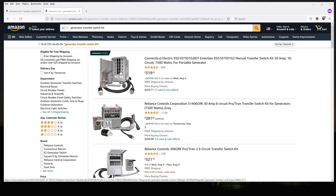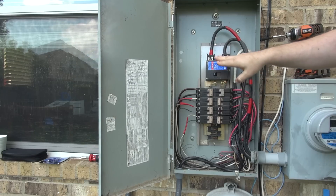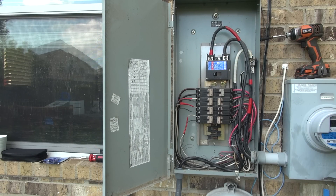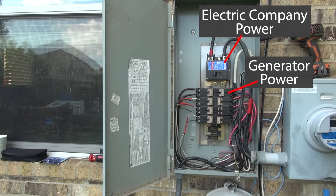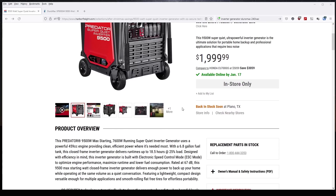I'm not going to spend a lot of time on this, because for me that was overly complicated and expensive, so not the route that I took. The other kind of power is going to be 240-volt AC. This actually simplifies the connection into your home because your generator power matches exactly the kind of power that you're already receiving from the electric company. You don't have to do anything special, and basically you're just swapping out line power for generator power and using your home's existing wiring for everything.